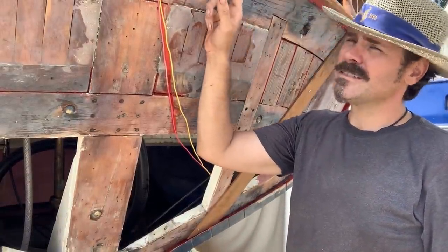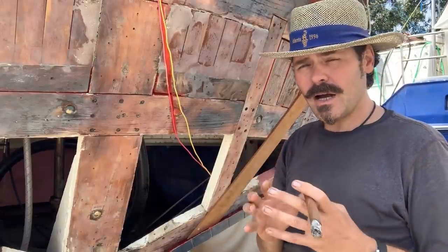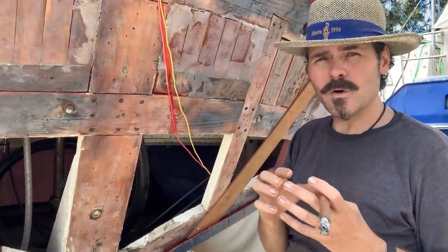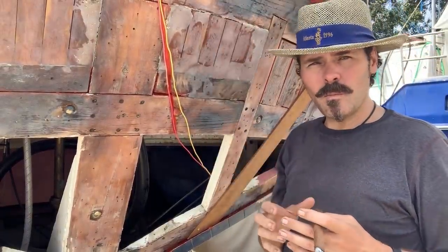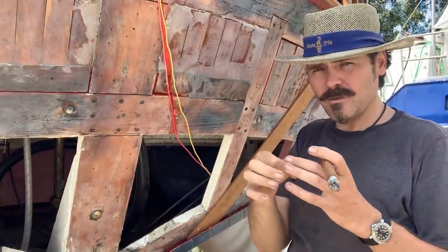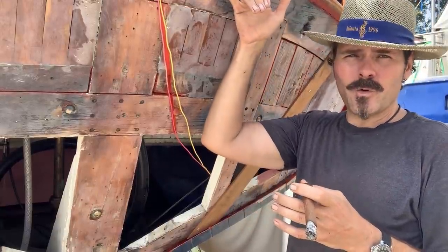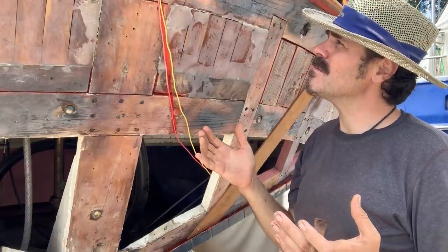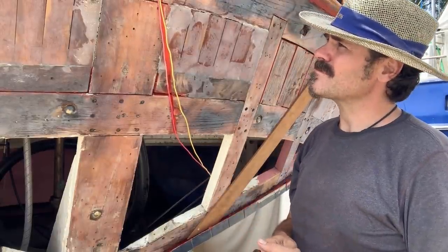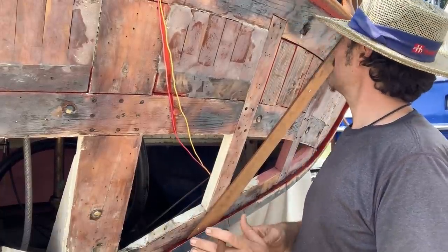That will make this tight, right? It's not going anywhere, and it's going to be completely filled with epoxy, but the epoxy will not stick to the bolt because the bolt will have wax on it. The wax will be on the full threads inside the nut. So basically, if I ever need to take the spindles off, the epoxy is going to be around the nut holding it all in place. And it'll be a perfect shape for the bolt. So I can just back the bolt out of the epoxy and it won't be any problem at all. And I'll be able to put it right back in if I need to. It's not going to go anywhere. So that is the plan there.